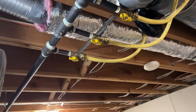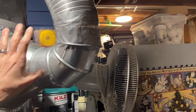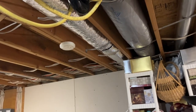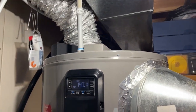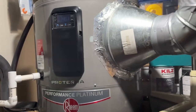Use the numbers in the manual to figure out what spec you need. If you can run 8-inch duct — reduce from a 10 or 12 to an 8 — run 8-inch, you'll be much happier and have no issues. I'm right under the bar, and I haven't had the A006 code come back. We were running 6-inch flex tube all the way down and it had too much resistance from all the ribs. As soon as we went to rigid, we've been fine — no over-pressurization. The limit is around 105, just check the manual. Your intake side also adds into that total.